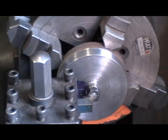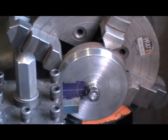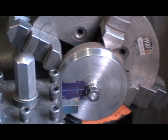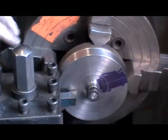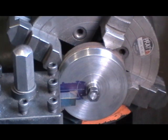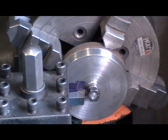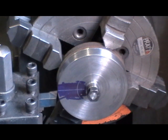Then I'm going to move out one inch from the centre, which on my metric lathe is 25.4mm. I've scribed a line on the diameter of one inch with a sharp pointed tool. Once I've got that on, while it's set, I've put my tool back into the centre, just touched onto the actual jig by a couple of thou, and then I've scribed a line across to give me my centre line. And I've done the same on the OD across there - just scribed the tool across - and that's given me a centre line.